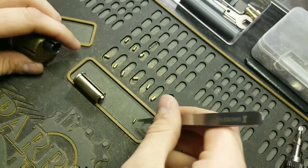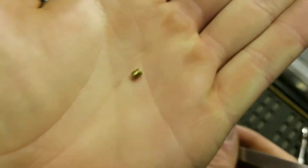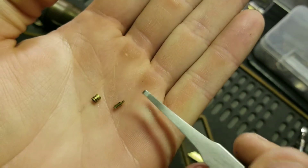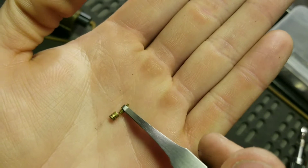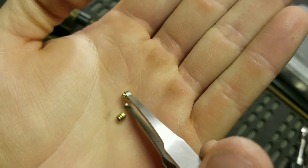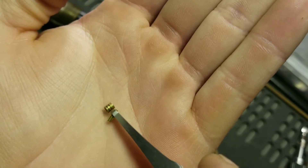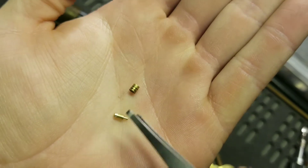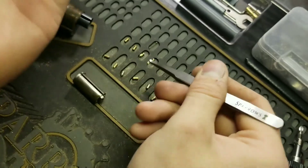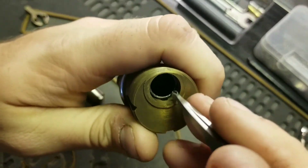Six is another kind of pin-pin. I took the sleeve from a pin-and-pin and then took a pin out of a tubular lock — it sits up in there so it doesn't go all the way through. It's a two-part pin, so when you're picking it, you push it up and the two parts come apart, giving it a massive false set. Oh wait, that's six — not four, let's go to five.